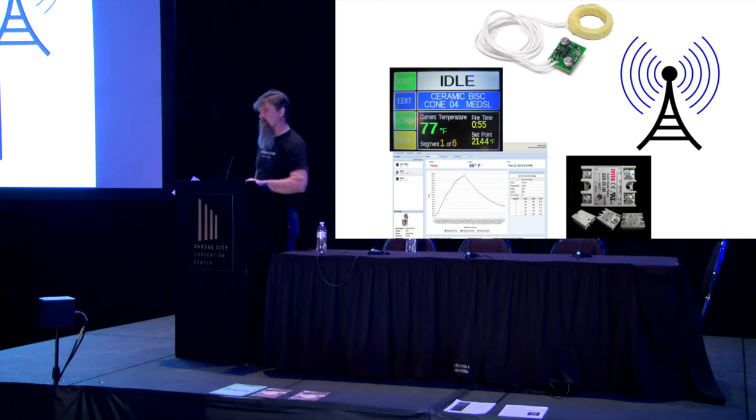I'll close out with a final example of that. We had a customer who called me recently, and she's having a problem with her slow cooling. She wanted her kiln to crash cool to 1800 Fahrenheit and then really slow down to about 150 degrees an hour until she dropped down to 500 degrees and then let it go. Her problem was she was getting error messages all over the place because her temperature was way too low. That's what the error message meant. And she's like, I don't understand, because I'm plummeting and it's supposed to do this. And I said, well, think of it this way. You're dropping too quickly. It's like riding a skateboard down a hill.